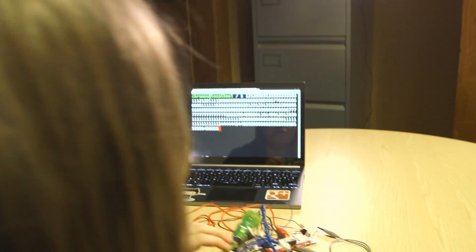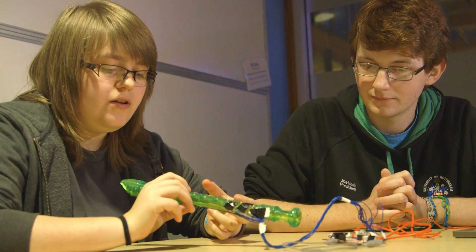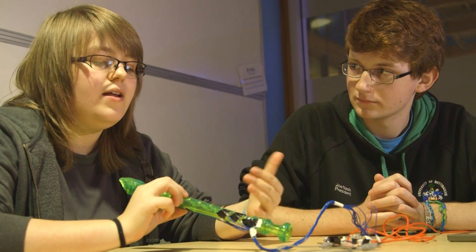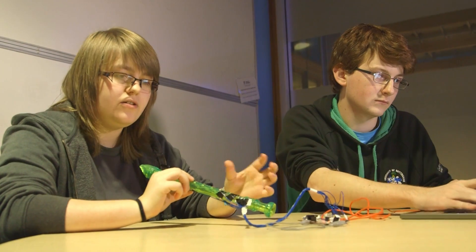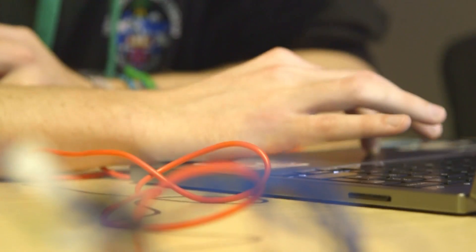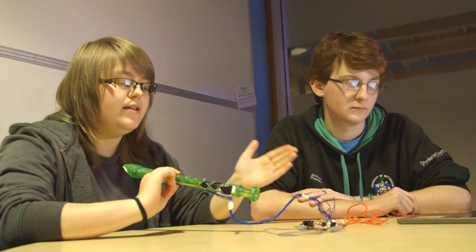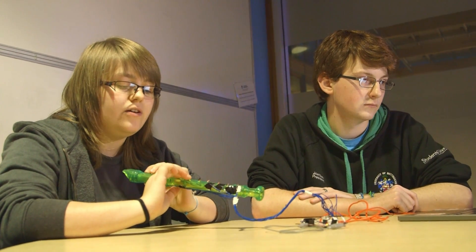What good is it having so many numbers on there? How do you get 'cabbage'? What happens is that it sends all of the numbers in a string in order. You can then write an applet that will let you take that string and switch on a case statement to say what letter should come from those — so we chose to do it so that if you played an A, a statement would say you've pressed 0, 1, and 2 and switch that so they would output an A onto the screen instead of showing you 0, 1, and 2.